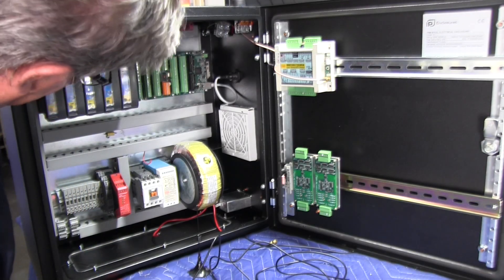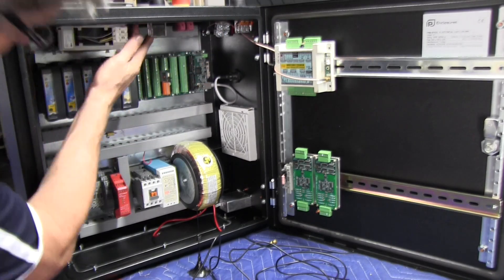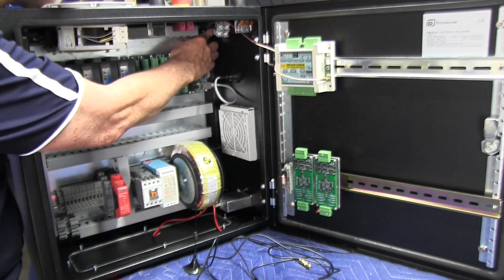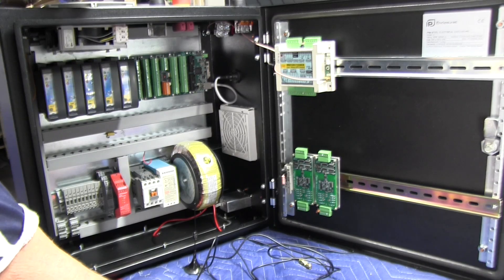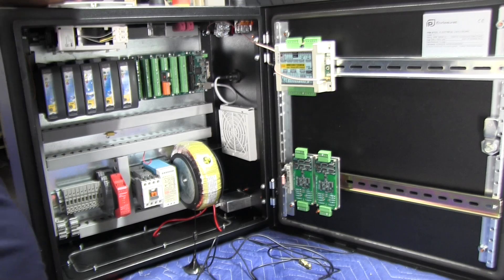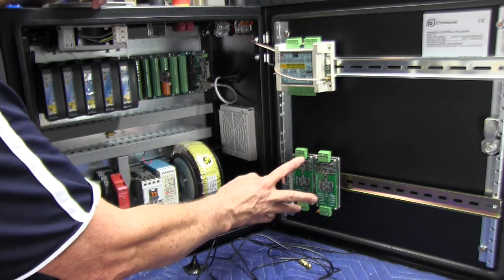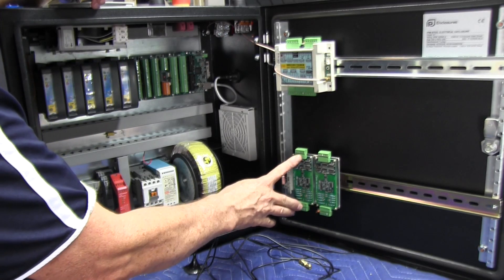The second THCAD is for ohmic sensing. The ohmic sensing circuit requires a couple of resistors — I've got these mounted in fuse boxes, which is a convenient way of doing it. This one is a 5-watt resistor, mounted proud of the surface to keep heat away from it. The other smaller one is a nominal quarter-watt, 390k — and this one is 24k — so that's for the ohmic sensing circuit. Rather than plugging the coaxial cable directly in, it's neater to run a separate fly wire and separate coaxial cable up to a bulkhead fitting.